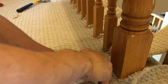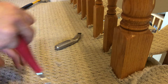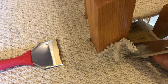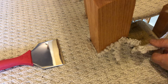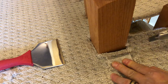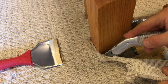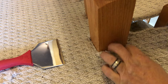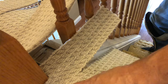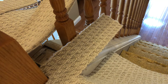If we need to we'll put a little glue around there. Berber is not my favorite to install. Now remember around this big spindle — it's got that steel plate in the back that holds it down. So we've got to cut that exact because there's nowhere to tuck it. We're going to run some special heavy duty glue from a company called PAM around there.